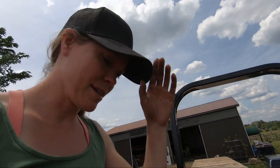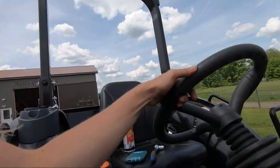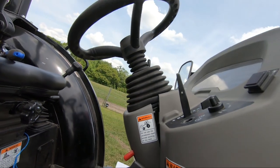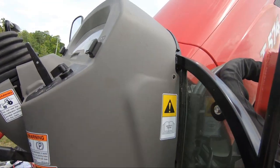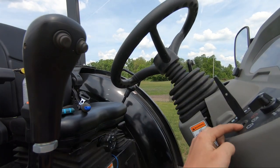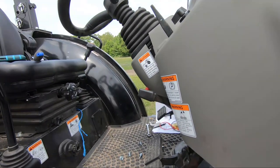You should be golden. Don't forget to tighten everything back up and put everything back together. If you're wondering how to take the dash off your tractor, there are bolts everywhere - we loosen the bolts on this section, there are two here and one on the other side. Then take all the bolts out of this section - two here, none on top, one here and one on the other side. You push it backwards out and you're good to go. One of the nice things about this TYM tractor is you can literally access pretty much everything on it compared to every other tractor I've worked on. Now we'll tighten it back up and get this thing back together so we can hit the road making hay.